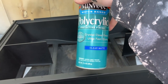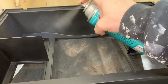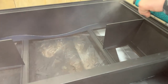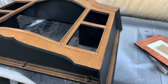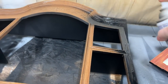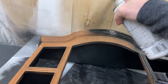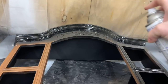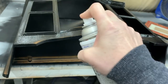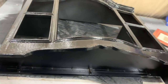To seal the black spray paint, I'm using the polycrylic spray. This is going to give that Rust-Oleum black paint a little bit more durability by sealing it with a top coat of polycrylic. After the polycrylic dries, I flip it over - I find that the polycrylic protects that paint enough so when I go to flip it I'm getting the most coverage. I'll go along the front and face of it, proceed to painting the rest with Rust-Oleum, and after that's dry I'll do the same thing with the polycrylic again for extra coverage and protection when flipping the piece over.